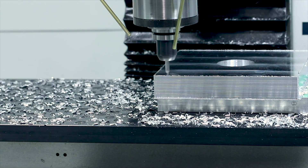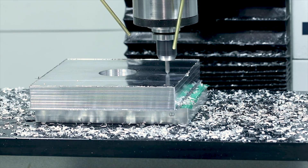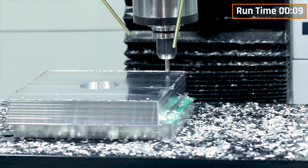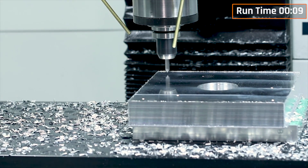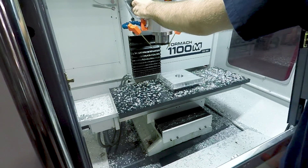For those of you who wonder why I usually peck when spotting, it's because this drill mill we use for spotting and chamfering has straight flutes at the end and I found it really helps it do its thing when spotting if you give it a little bit of assistance breaking those chips.